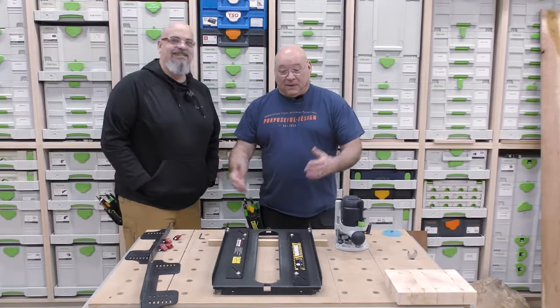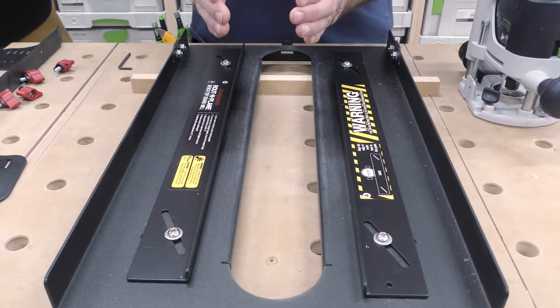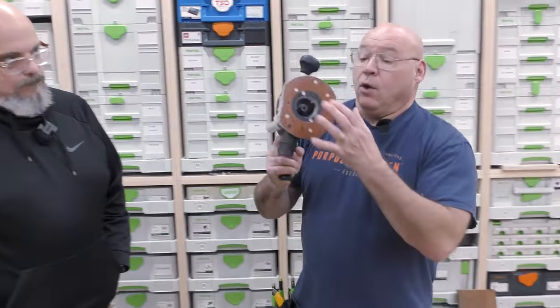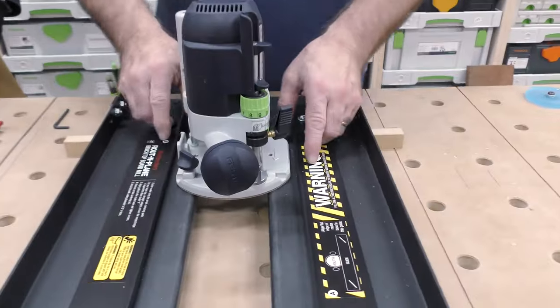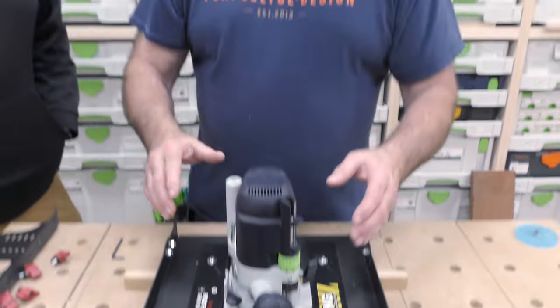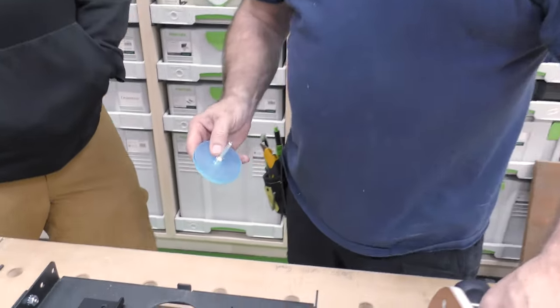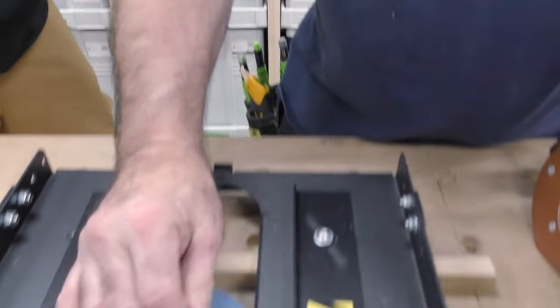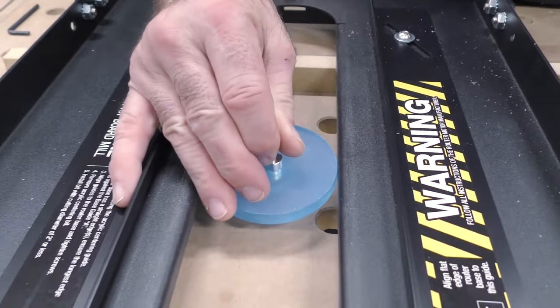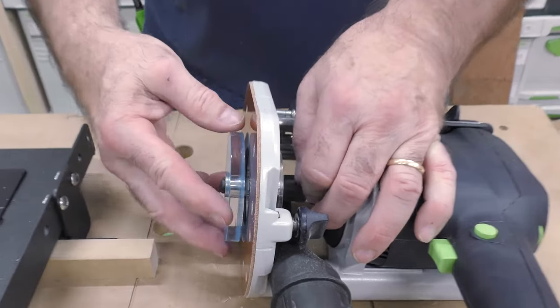Next, we need to take the router and adjust and capture it. This is the best part about the routing plane. I have a Festool OF 1010 here — it's got two milled flats. If I put it on here, see how it just comes in and captures it so we can go back and forth. Now we have to find a way to center it. Woodpeckers supplies a quarter-inch arbor shaft, and with my quarter-inch collet that'll help us center it right in there — look how perfect that is. Just chuck it up and center it just below the base.